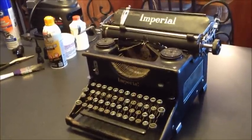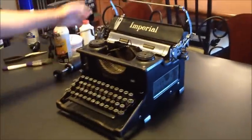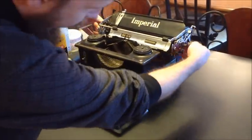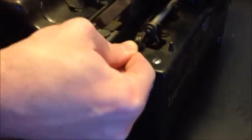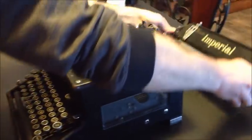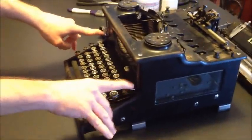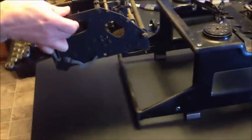I'm going to hand the camera to Dave. You'd probably just walk right past this at an antique mall if you didn't know what you were looking at. That comes right out — pretty cool. If I go over here and grab this little tab, this little tab is actually the draw band. Draw band 101. It hooks on that little pedestal. Now the draw band's off the carriage. If I come over here and press these two, I've got the carriage off. It's a repairman's dream. And then if I push these, I can get the entire action unit out of the machine.